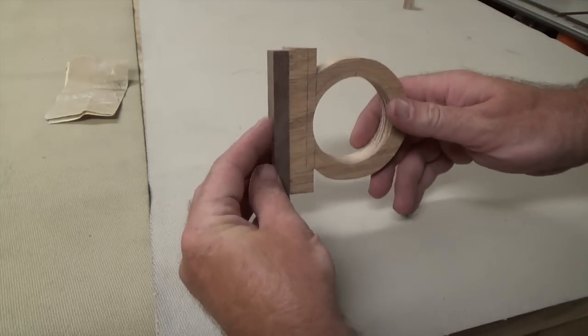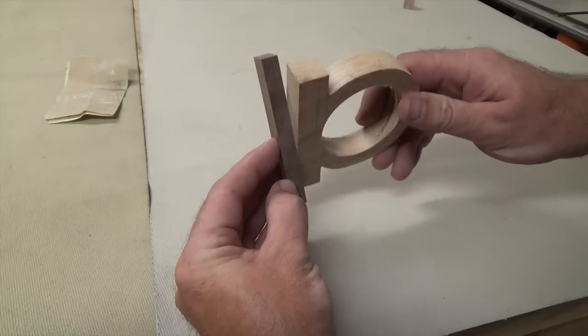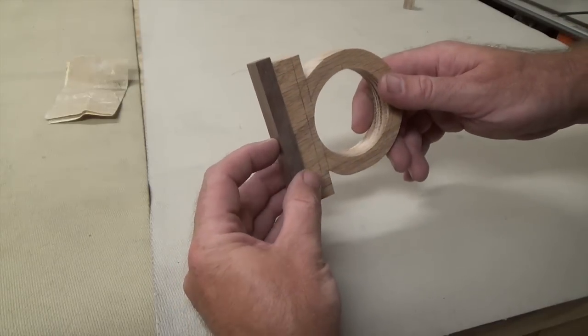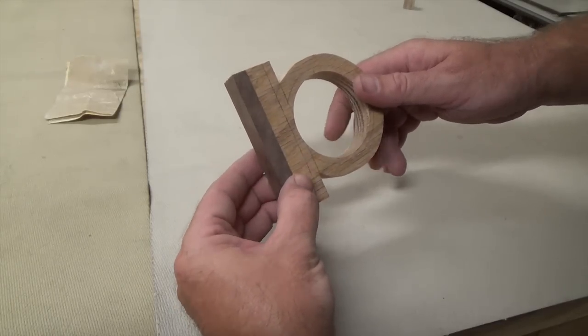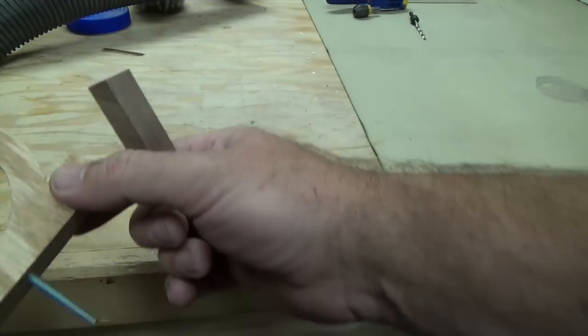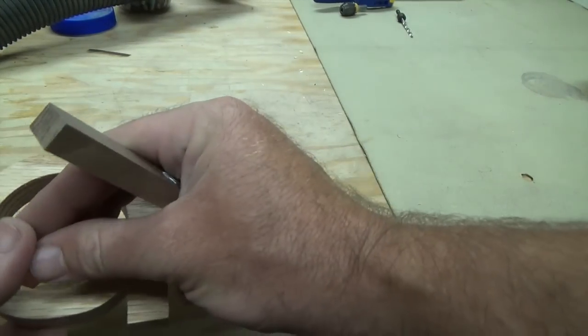And the purpose for this is that when it's mounted to the drill press post, there will be some pivoting here so that we have some adjustment to this bracket. So I'll go ahead and do that, and then I'll come back and show you the results. So here's our original piece. I've got a bolt countersunk into here.